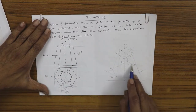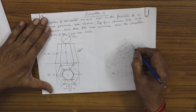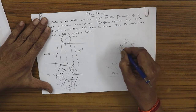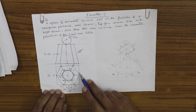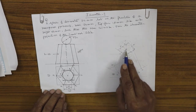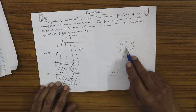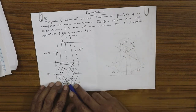Inside the top rectangle, locate the 6 points a, b, c, d, e, and f, just as you did for the bottom hexagon. This gives you the top hexagon. To recap: for the bottom hexagon, make a rectangle box, locate the 6 points. Take the height 50 mm center-to-center, draw 30-degree lines, then mark l/2, l/2, b/2, b/2, draw parallels to get the top rectangle, then locate the 6 points a, b, c, d inside it.